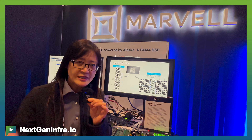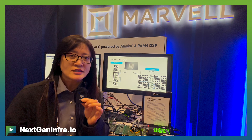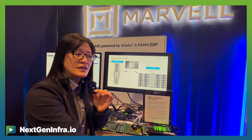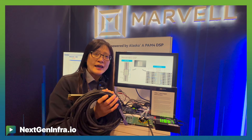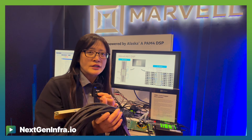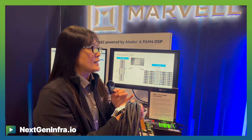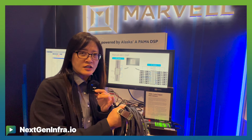Because of this, the need to extend the reach from five meters to seven meters becomes essential. Marvell has great technology that enables that solution. We now have seven-meter cables in 28 gauge, and one end breaks out 800G to 2×400G — perfectly fit for the AI server rack to connect between the switch rack and the server rack.